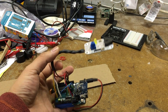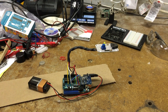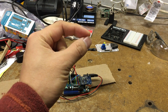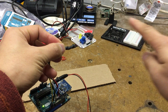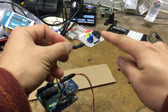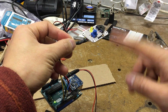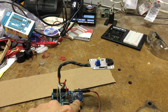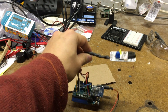So the idea here is that I want to be able to attach this to any type of bike and put just a little tiny reflective sticker on the tire. Then I point this at the sticker so that every time the wheel turns, it's going to register at least once. I can then measure the time between the reads, which gives me its revolution over time, and from there I can figure out speed and send it through Bluetooth to the app to do something more interesting.